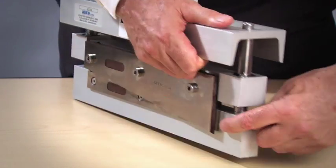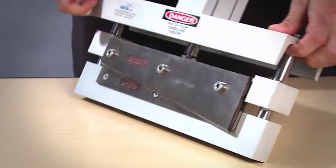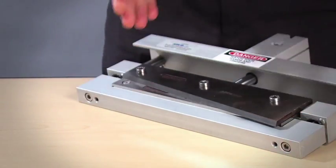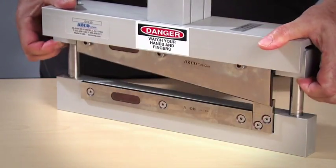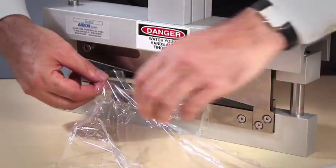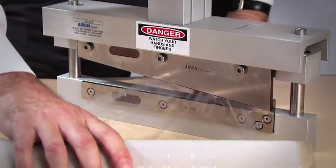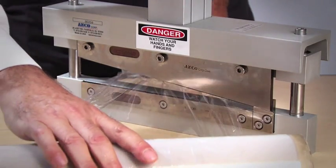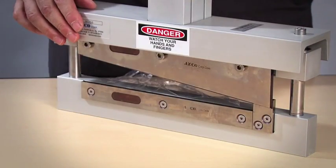If you notice when the knife is closed, there's a very, very small gap here — probably one or two business cards — and on this end the blade is in direct contact. That's creating a pure shearing action for our knife assembly. Just to be sure that it's set properly, we're going to cut some saran wrap. Saran wrap is extremely stretchy and hard to cut — unless the blades are set properly, you're not going to be able to cut your material. And here, we've just cut the saran wrap.